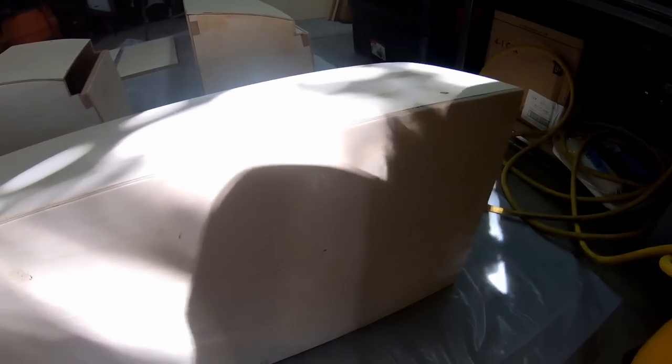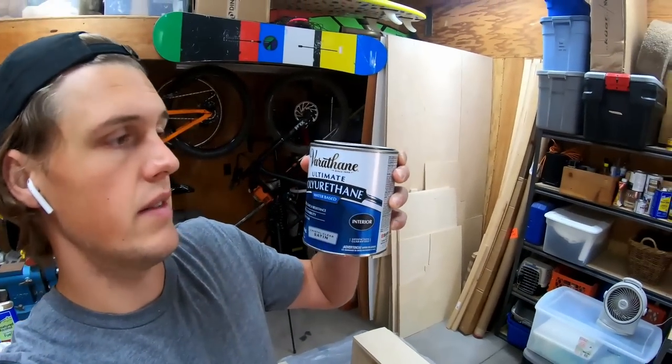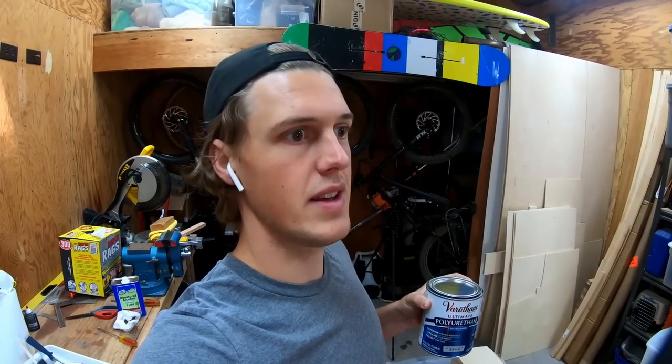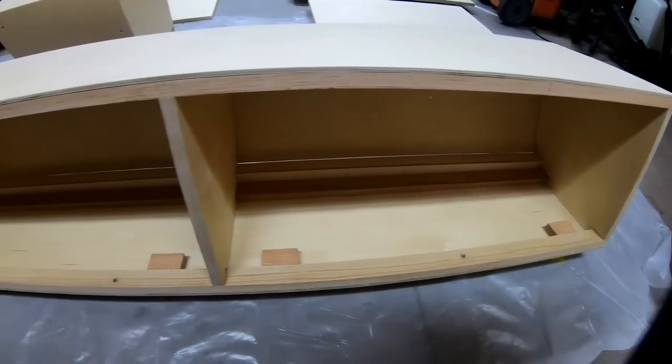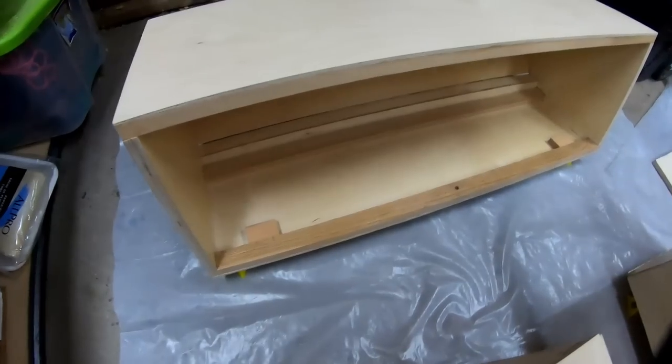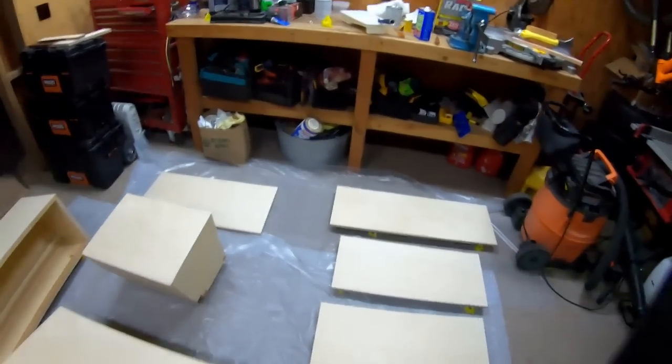The first thing we're doing is applying three coats of water-based polyurethane on all the non-exterior-facing cabinet surfaces. I'm also putting it on the portions touching the van directly so condensation has a better chance to dry rather than rotting the wood. All interior surfaces get polyurethane for scratch resistance and general finishing since those surfaces will be used quite a bit. Three coats are done — they're looking and feeling awesome, very sealed.